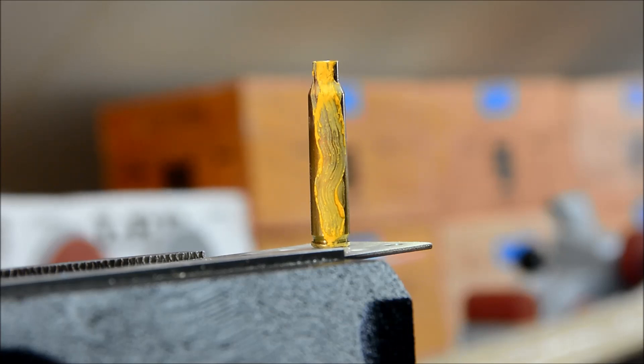We're doing this with conduction to avoid a direct flame on the case. You can see the steel is starting to get really, really hot and yet it's not conducting as well to the brass yet, just because it's limited surface area when you put the brass in on there — it's not a perfect contact surface. So it continues to heat and eventually we'll get enough heat to conduct into the case.